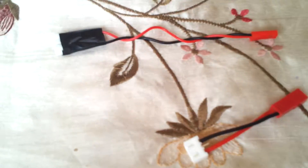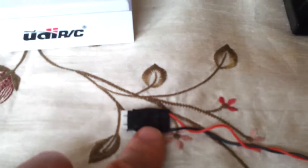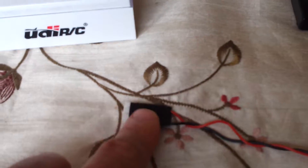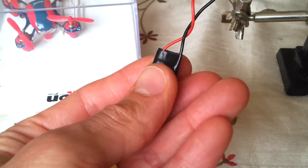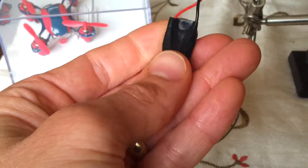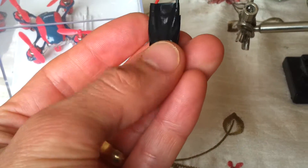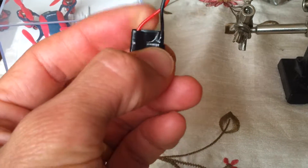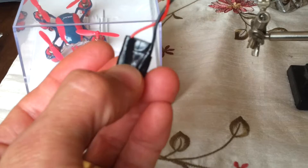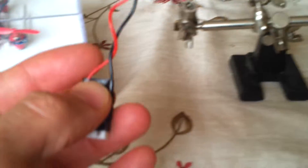I've made two. I've made a long one — it's soldered inside there, insulated separately, insulated again, and made sure the wires are in no way touching. They're all insulated individually, soldered onto the pins, insulated individually, and then isolated again. And I've taken out the middle pin so nothing can touch and short it out.